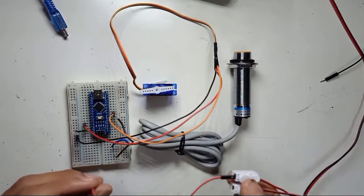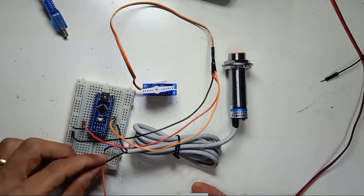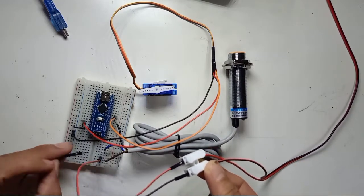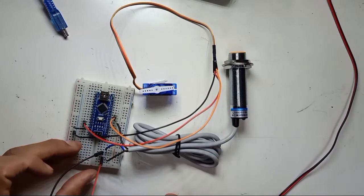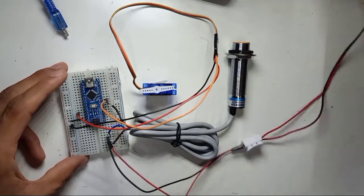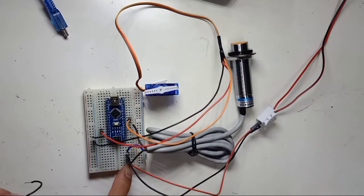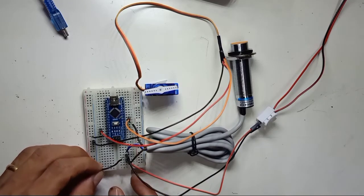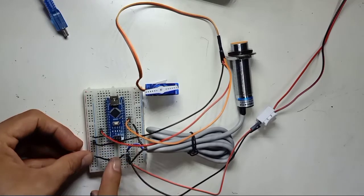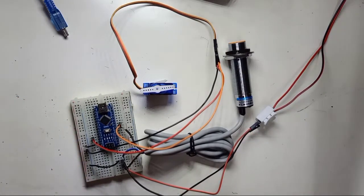The brown wire needs to be connected separately to 12V. So the 12V positive connects to the brown wire of the proximity sensor. The 12V negative connects to the blue wire of the sensor. Then this 12V negative also connects to the Arduino ground — you must not forget to connect the 12V ground to the Arduino ground in order for it to work.